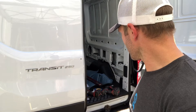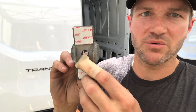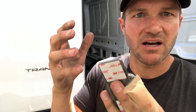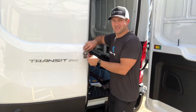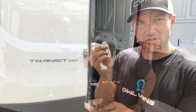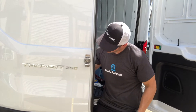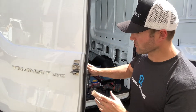I've got the hole in the door drilled. I've got some spacers I want to put in there, and I also put some 3M VHB adhesive. The goal is that it's not only going to hold this in place while we put everything together, but it's also a foam — so it adds a little cushioning and we're not going to wear a hole through the paint. I used the adhesive to mount the door bracket, and I was able to slide a thick washer in between those two pieces of metal. Everything still looks pretty straight, which means it's sandwiching evenly on that door — and the washer is sandwiched on the inside as well.